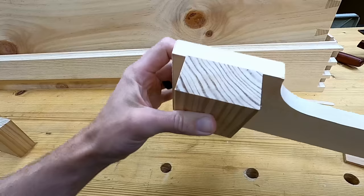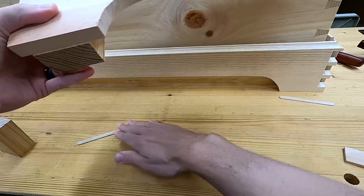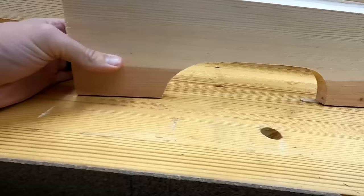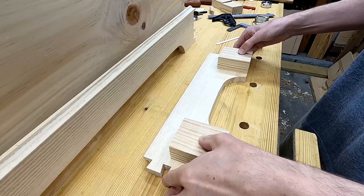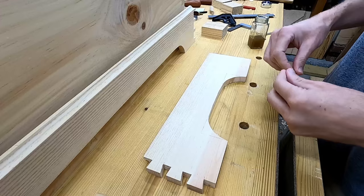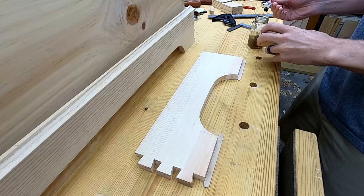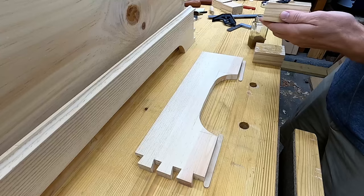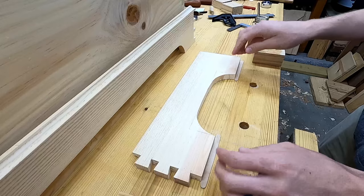The glue bond would actually be stronger if the glue block were going in the same grain direction as the trim board, but pine's pretty soft and I want all the compressive strength I can get out of that glue block. Just that shadow line right there is exactly what I'm looking for — I think it looks really good. Here I'm getting ready to glue these things up. I just made a video about the glue, which did really well. You would not think glue would be such a controversial topic, but I guess this is the internet after all.